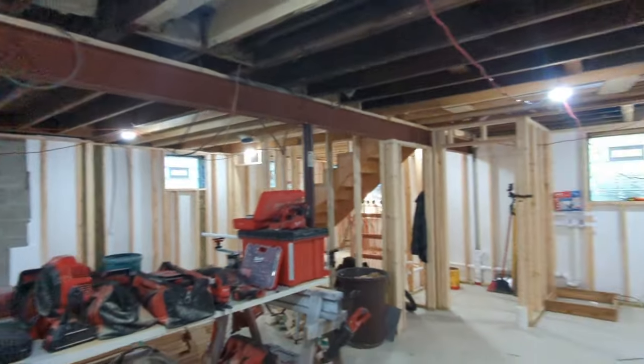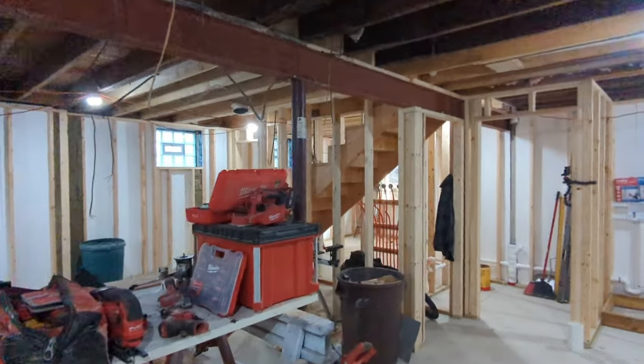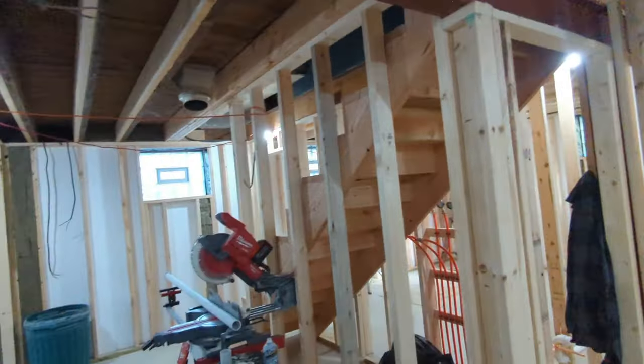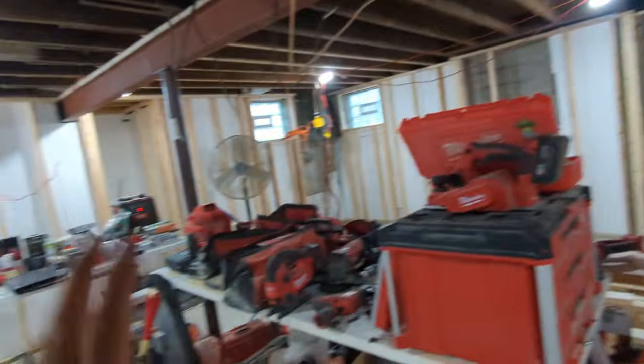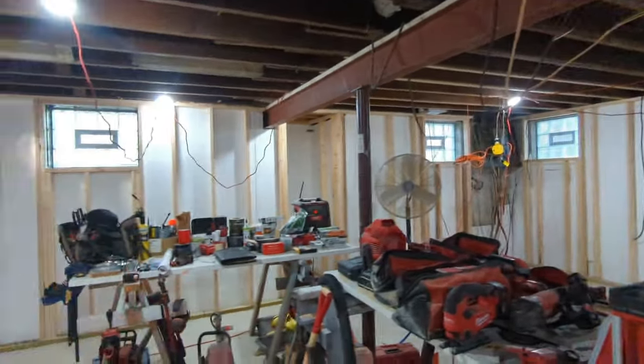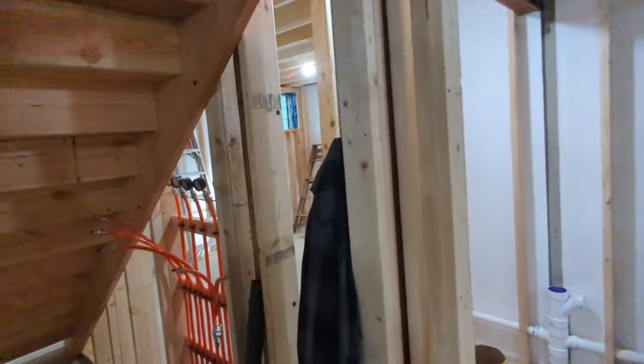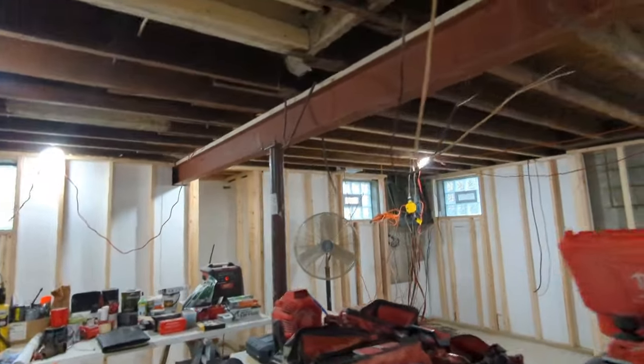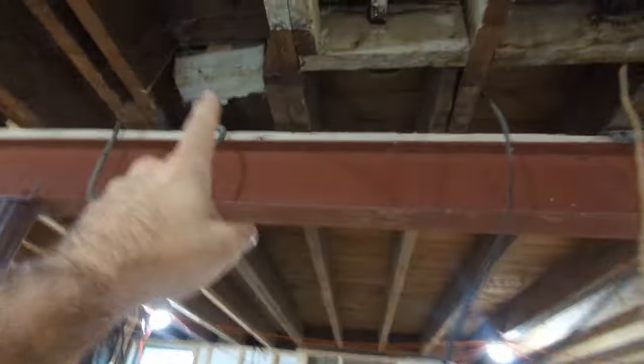It's taking heat all around the house to weird locations and places that aren't necessarily the best place to supply heat and take cool air back from. And then we've obscured this duct going upstairs. Again, all these problems go away if you go hydronic and you are pumping glycol: you just take the hot glycol over into this room and tie it into all these. You take the hot glycol to this system overhead here and get the first floor. And then you could go up the old ducts, the old verticals here, which go right up to where heat used to come out on the second floor.